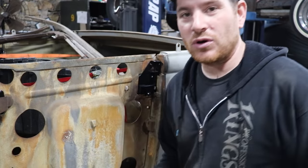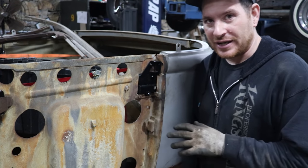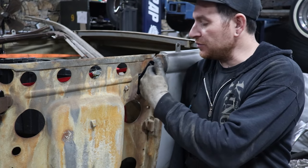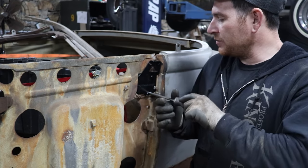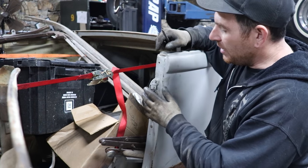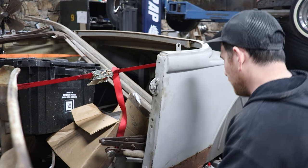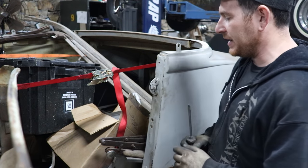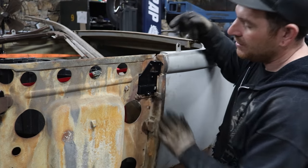Alright, so got my door tweaked. What I ended up doing is, I actually did a bunch of stuff. I loosened the screws for the latch and got the door catch as far out as it could go. But the problem we were running into is that the inside of the door latch itself was hitting on the stopper and still wasn't quite latching. So what I found is, in the door jamb, from years of slamming this door shut, the door opening right in here was tweaked a little bit. So I took the latch off, took a big adjustable wrench here, and just bent on the door jamb right where the latch mounts, just a little bit, just to tweak it so the catch was allowing it to go past. I lubricated everything, pushed my catch back where it needed to be, and now it latches pretty darn good.